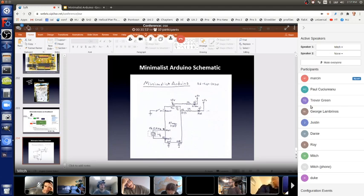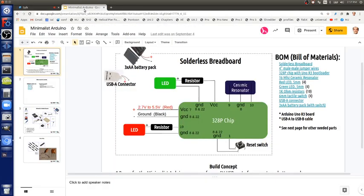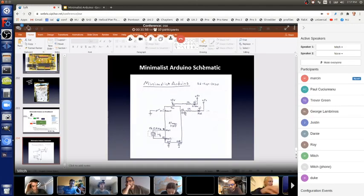you know what, this schematic's wrong, I'm totally sorry. This LED's not supposed to go here, it's supposed to go to ground, not to plus, because this is going from plus to plus, so I drew this incorrectly. This should be ground, not plus. I'll fix that in a moment. So the other side of the resistor goes to ground, not to plus 5. But this side, the minus of the LED, the red LED, goes to one side of the resistor, 1K, the other side of the resistor to pin 13. Whole thing.